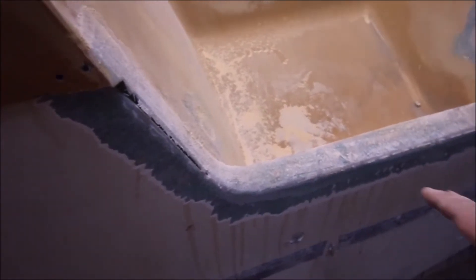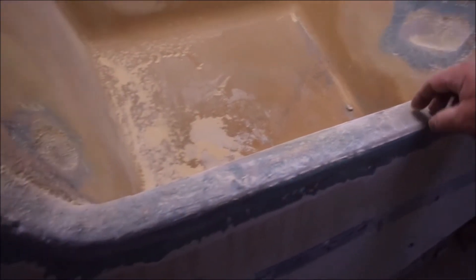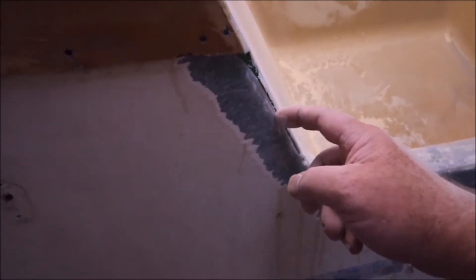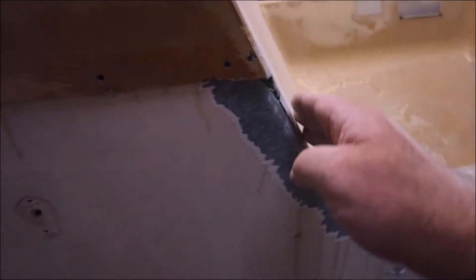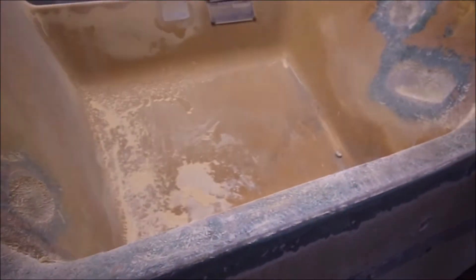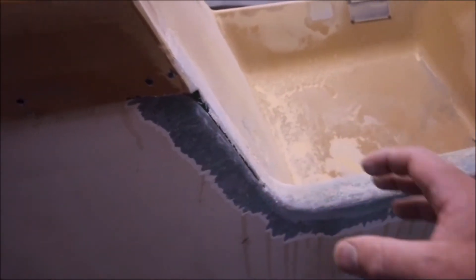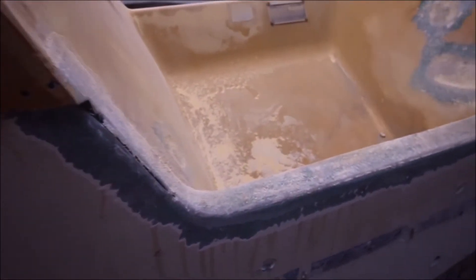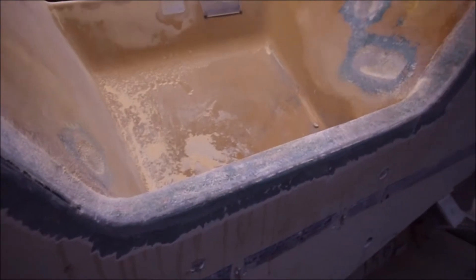You can see what we've done here. I've ground back right around this flange edge, around the top of the transom. The original deck mould comes over and you can see where it actually finishes — right there. That hasn't sealed quite as well as what I'd want it to. So now that I'm sure I've got a good bond right across the top here, I'm actually going to wrap another piece of fiberglass right around these edges. That's going to not only make it immensely strong, but also keep any moisture out. We've got timber just inside there, and as sealed as it is, I still don't want water ingress over the lifetime of the boat. Once this is done, this will actually be about five times stronger than what the original was.